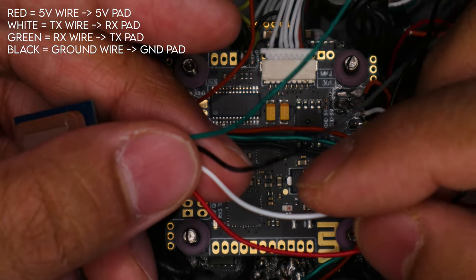After the reboot, go back in, click Connect, then go to the Configuration tab. You can see my craft name is SupaFPV. Scroll down and click the GPS toggle on. Change the protocol from NMEA — which is likely the default in Betaflight 4.2.3 — to UBlox, with Auto Config turned on and Ground Assistance Type set to Auto Detect. I remember mine was set to None and I had to change it to Auto Detect. Then click Save and Reboot.